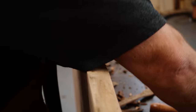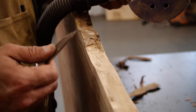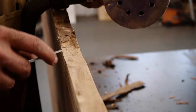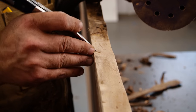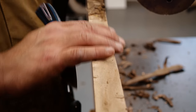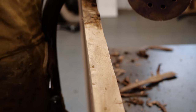What you saw me using is called a draw knife — great for removing the bulk of the bark. You want to make sure you remove all of it, because later it'll dry and fall off. The only way to avoid that without epoxying it in is to remove all the bark down to the sapwood. I'm using 60-grit on the edge of my Random Orbital. You can also use a wire wheel on a grinder. You get these little patches that you need to get rid of before you can put finish on. When you get down to the sapwood, you're good. Don't worry about altering the live edge too much — you have a half inch of sapwood and it'll still look like a live edge.